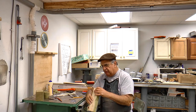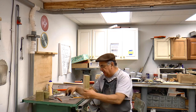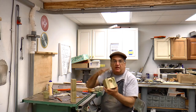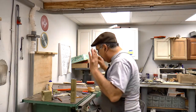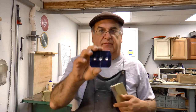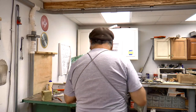I'm going to screw this on the end, go over to the lathe, turn it — same as the other thing, you've already seen how I did that. Then we're going to come back and split this thing in half. One thing I forgot to mention when talking about this plate: get center lines on the plate — that makes sense, right? Have center lines on it, then two screw holes, and then the center hole in the middle.